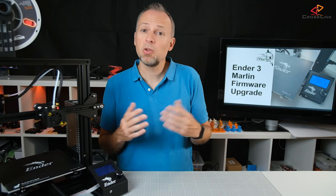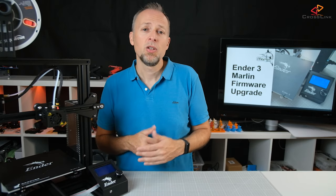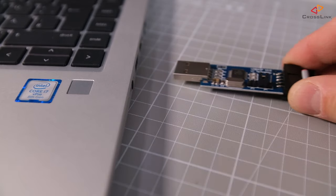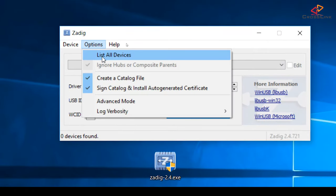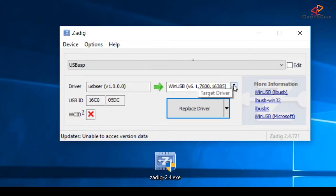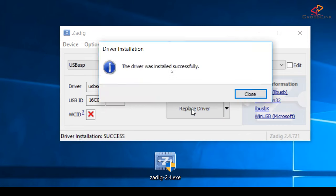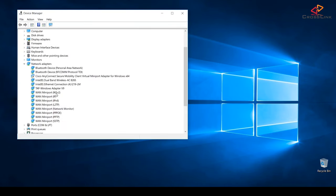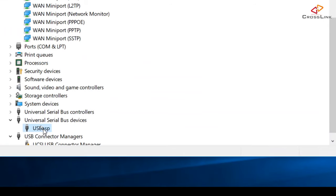With Windows 10, by default the USB ASP is not recognized correctly, so we need to install a special driver to make the USB ASP visible to the Arduino IDE. The easiest way is using the Zadig tool — link is in the description. First plug in the USB ASP into a USB port of your computer, then open the Zadig tool, select Options > List All Devices, find the entry called USB ASP and select it. Then from the list of drivers, select the WinUSB driver and click the Replace Driver button. After installation completes you should get a confirmation popup. Finally, verify the driver is correctly installed by opening Device Manager — there should be a USB ASP entry in the Universal Serial Bus Devices section.